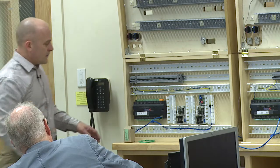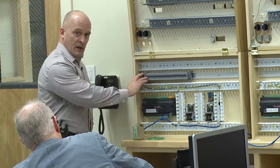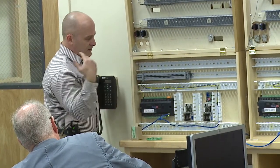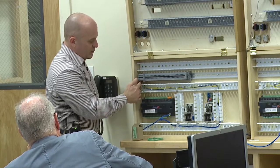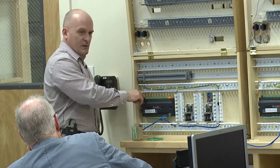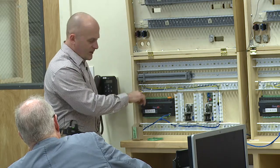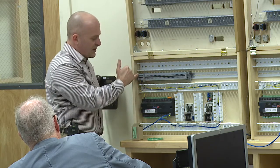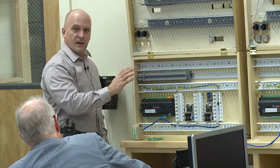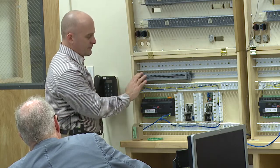Make sure that when you do that, okay, you make use of the terminal blocks. When I was taking the wires loose, I saw all kinds of crazy stuff in these trainers, where people were trying to use one as a node for three or four wires jammed into one Wieland connector and all kinds of stuff you usually see in the field. But remember, you have these terminal blocks. You can come off the top of these and make it easy on yourself. You shouldn't have to use any wire nuts or anything like that, okay?